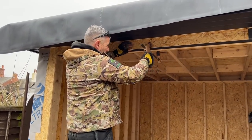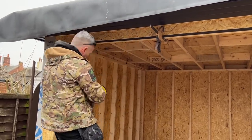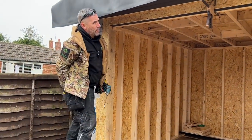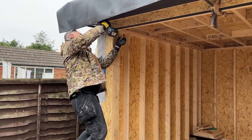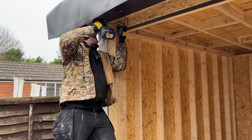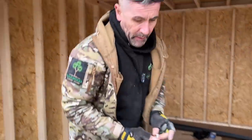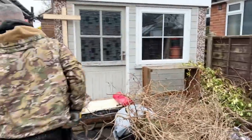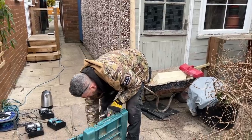I've overlaid the bottom there as well — it'll still take the slate battens. Now what I need to do is get some OSB fixed to this steel here. We normally use 110mm screws — the roofing screws we used to fix the steel beam to the wall — but if you try and put a 110mm through, the steel is 80mm so it hits the other side but you've burnt out the end already so it won't actually hold. So I'm going to use some smaller ones, which aren't as heavy duty — the thread isn't as good and they don't cut in as well.